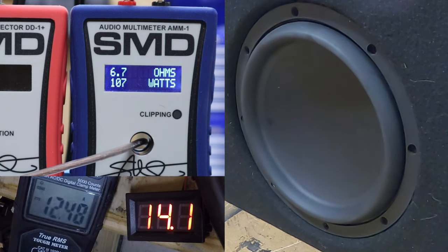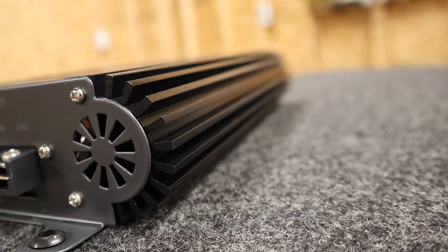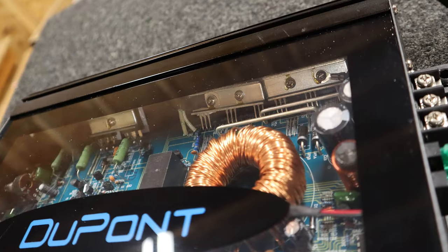Playing music, we get more power. Notice also that the impedance is lower when playing music. You very rarely ever get all the power out of your amplifier, so what we're seeing here is perfectly normal. But power is not the most important thing — there's one more really important thing I want to show you.